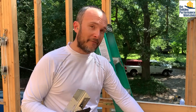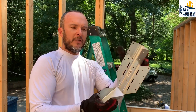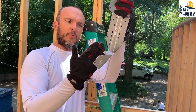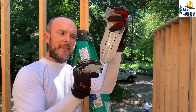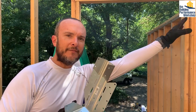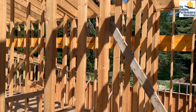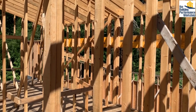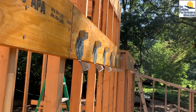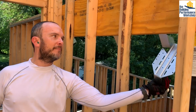The clips we're using to put these in look like this — they have a little hinge that we're going to sit the joist up in and then put to the right angle. These all need to go on the outside of this ledger. A ledger is a big piece of continuous lumber that you hang other things from in the direction perpendicular to it. So these are going out here — you can see the bottoms of them here.